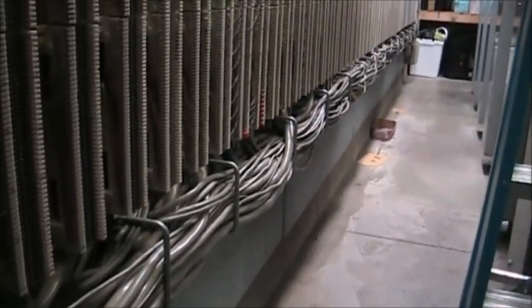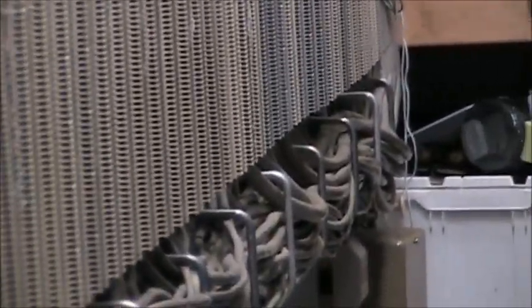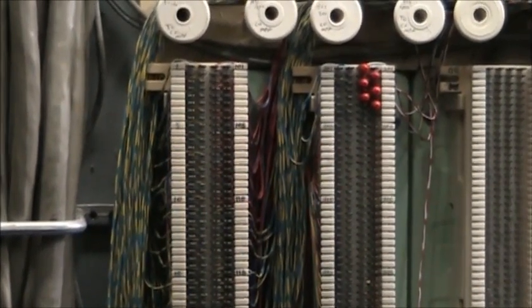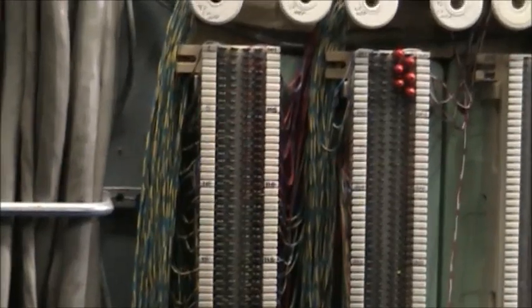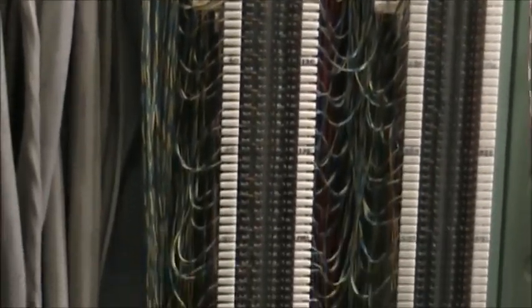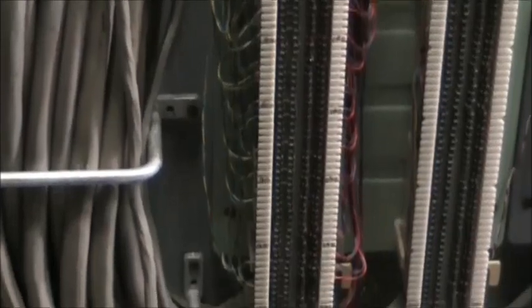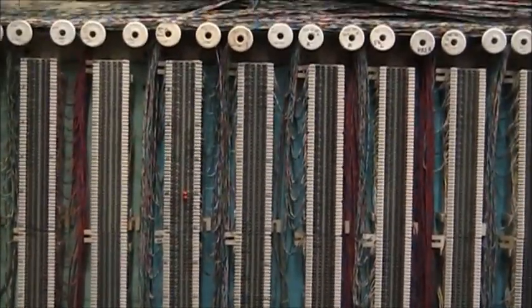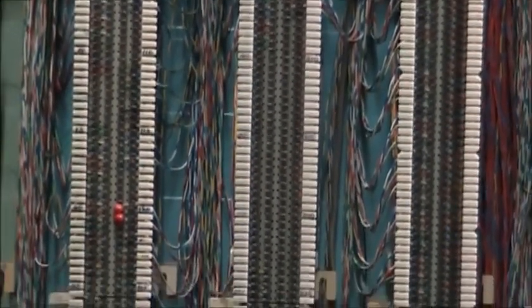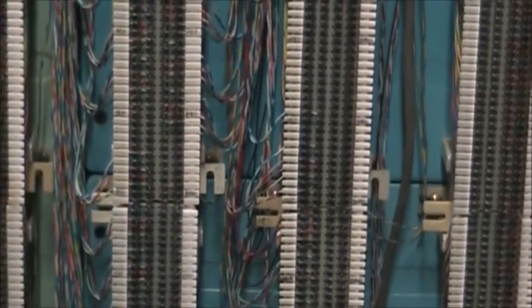Here's a view of the cables going into the bottom of the 66 blocks — there are many hundreds of them. The green boards have the first two rows of blocks as 400-type pairs. At this point I have about 250 or so of them cross-connected to the line cards in the 620 panels or to the 584C panels discussed previously. I'll zoom in on some hundred-pair cables connected to the back board within my residence. The cross-connects you see are lines going to telephones within the house or to an adjacent building.